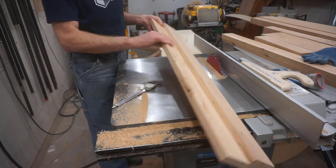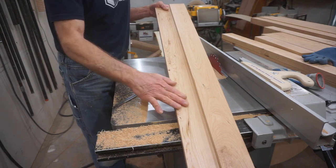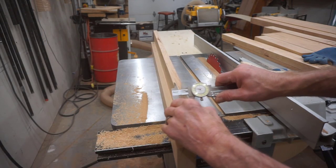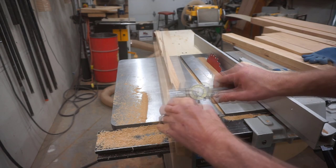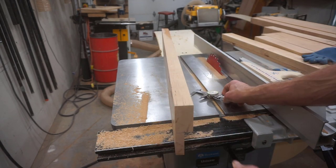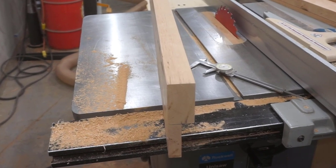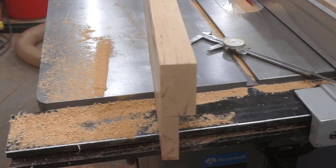And that's a big, bold cut, but with a sharp blade, a good setup, and a steady feed rate, the result is going to be more than acceptable. And I've got the 3/4-inch step that I need for the finished jamb. The jamb here is 13/16, and I need to end up at 3/4. And this is that same 1/16 of an inch over 1.5 inches for the finished width I want. I could just leave this, but I'm going to totally eradicate my little predicament here by milling the back surface of this jamb so that it ends up at the dimension I planned on.